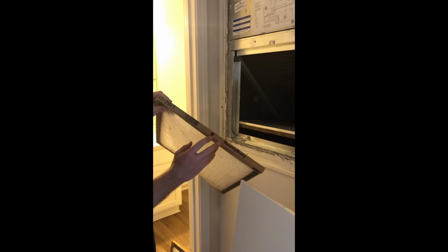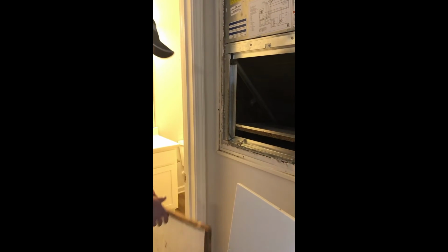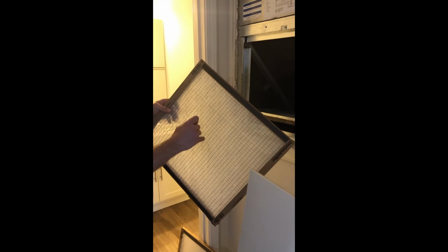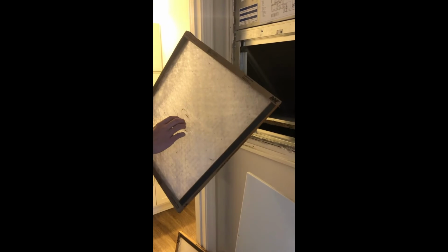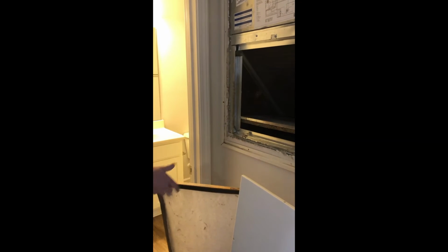Take this air filter. We use 18 by 20s here in the Bradleys. This here is our airflow arrow. This guy is going to go into the system. The reason why we have this little nice net here, it's going to catch all this loose fiberglass from going into the system and just make it run better.